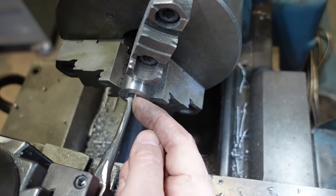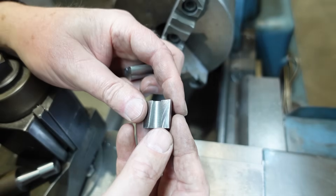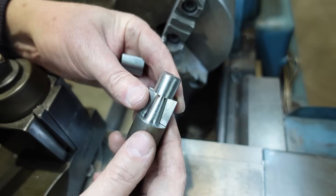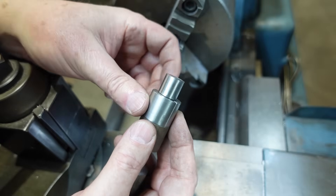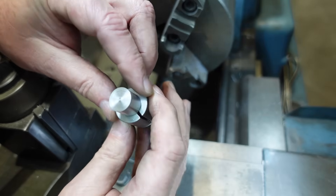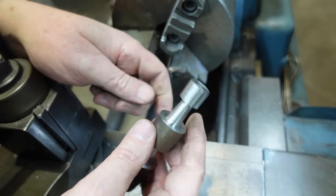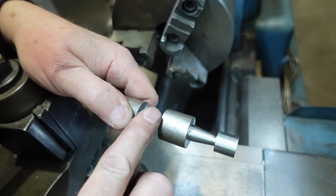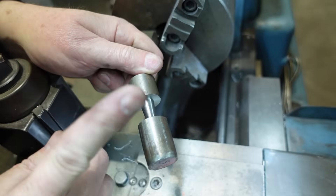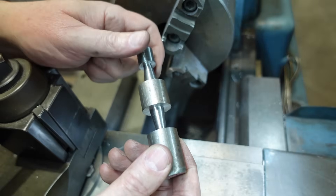Here's my split bush — I split it with an angle grinder, so that's why it's looking a little bit hacked. But if I do that you can see how it all comes together — it sits on there like so. I can clamp that in a three-jaw chuck, being mindful to have two jaws there and one jaw there sort of thing, and that will hold it quite steady. So I can now come along and shape this ball and this ball, then turn this round, part that off to the appropriate length, take it down to five-eighths, and do the ball shaping on there.